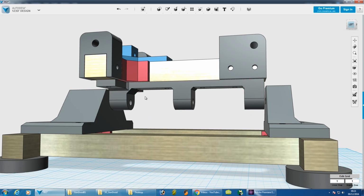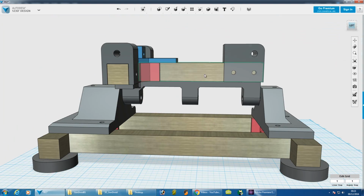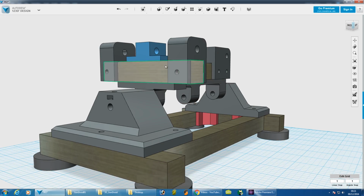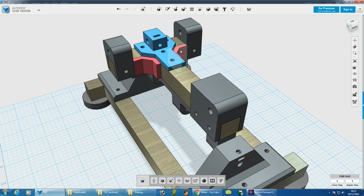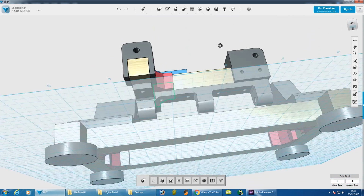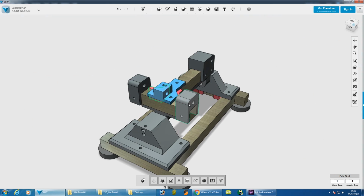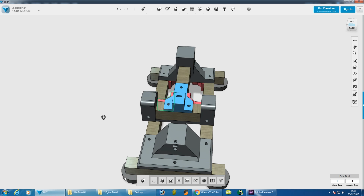So I've got a hinge point that goes across the bottom here. Again, this is all going to be bolted on with those T-nuts to the piece of extrusion, and a T shape here. Now I have put metal brackets in again, or left space for them, and I've also got this ABS bracket which is a bit stiffer than the HT, and that's just going to sit on the top, and we've got the HT in a T shape on the bottom there, so that should provide some extra rigidity, although I think the metal brackets are pretty strong.